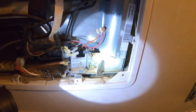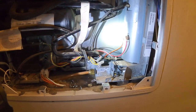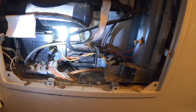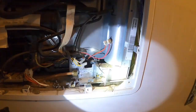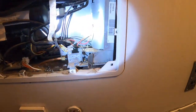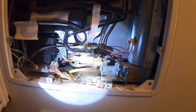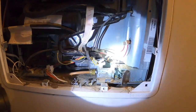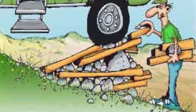And then I'm not using any more propane. When you're going down the road, they recommend you shut off your propane tanks — but then how are you supposed to keep your stuff cold when you're driving for seven or eight hours? The absorption-type refrigerator also takes a while to cool down initially, and you're supposed to keep it level. I'm pulling into Walmart parking lots, brother-in-law's driveway, and I leave it connected to the truck with no opportunity to level the trailer. With a compressor, I don't have to worry about that.